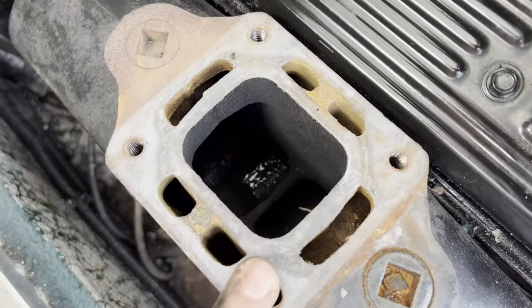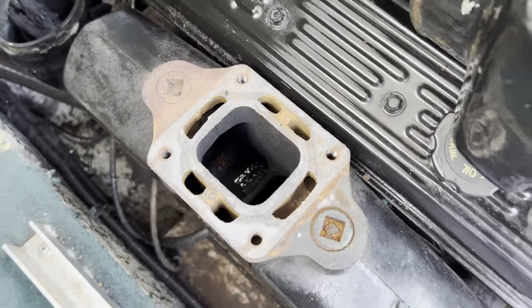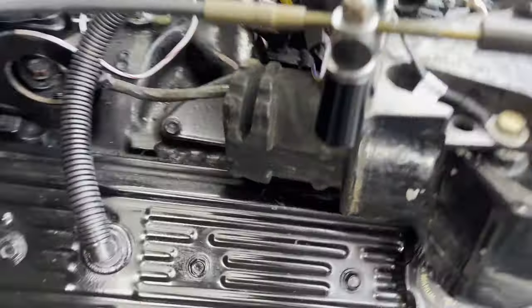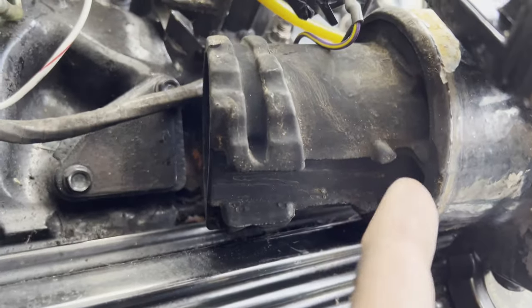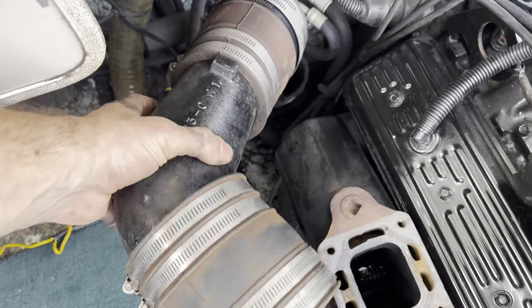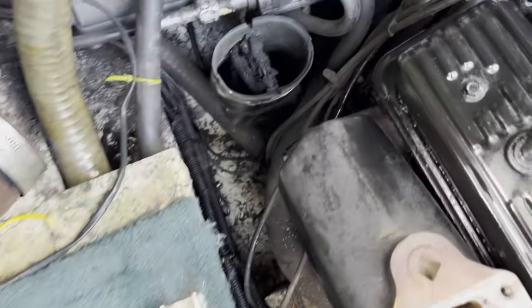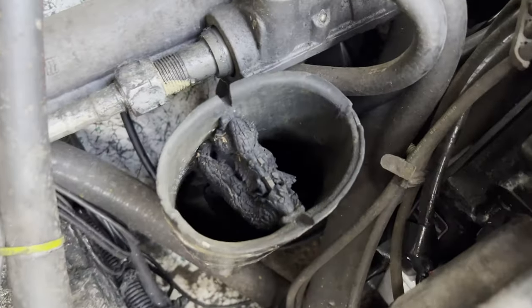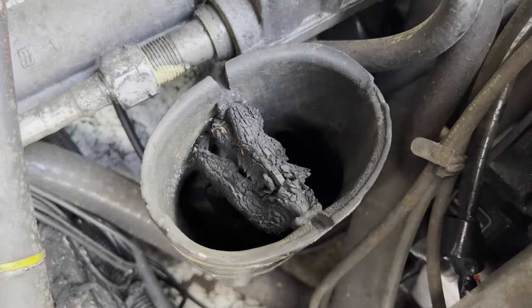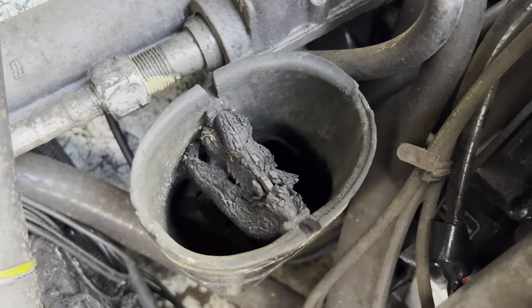right here, that just goes right down to your exhaust valves, and then you have this riser, which I already pulled off, and that dumps a combination of water up here and exhaust right here into a mixture into this elbow, which just connects with these flexible rubber couplings and worm gear clamps, and that goes down to this Y pipe. So in this Y pipe, this nasty little critter here, that is our shutter. So we're gonna have to pull that out.